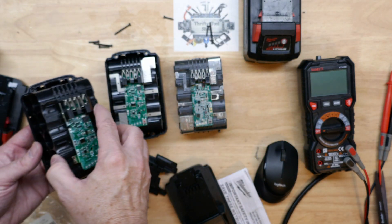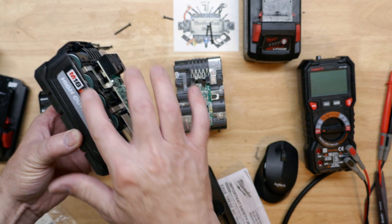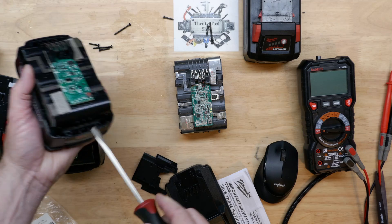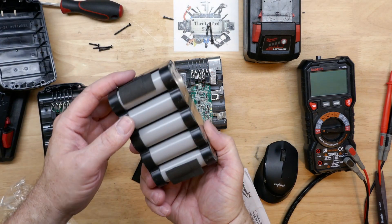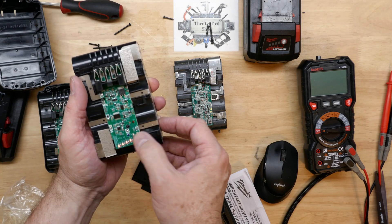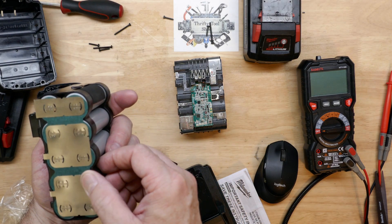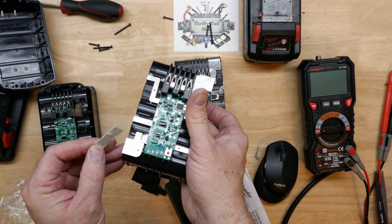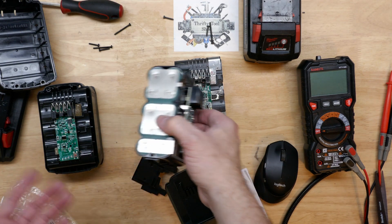The kit I just bought is not built yet but it's going to look very similar. The kit does have the little sharp-pointed screw — that's one difference — but otherwise it's unreal how close this pack looks. Gently prying the cells out, we do have 21700 cells — almost identical to that kit. One hundred percent not a Milwaukee pack: no markings on the cells. That was the first giveaway, along with this push button being harder to press than normal, and of course all LEDs lighting up at the same time — a pretty good giveaway. Looking underneath, it's soldered — a nice-looking job — but Milwaukee does not do that.